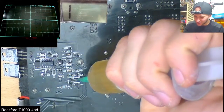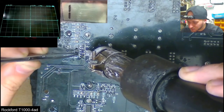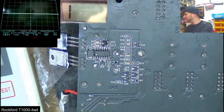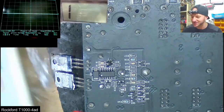This took quite a while, and there was a lot of removing parts, testing, and swapping parts between the good channel and the bad channel to no real avail. Do you reckon we're on the ball with Q41 being the bad part? I can't really see how it could be anything else.